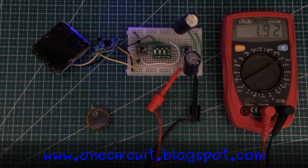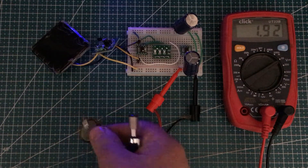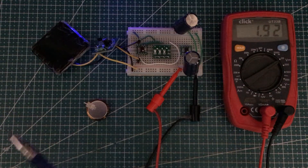What's happening with the Supercapacitor Perpetual Light project? Well, it continues to be an interesting journey. Originally — I'll link the video up here — I put in a 4 Farad supercapacitor and was overjoyed to see it working, but not so overjoyed when about 15-20 minutes later it stopped working. So then I swapped in a 30 Farad supercapacitor and was getting probably around the 40 to 50 minutes.